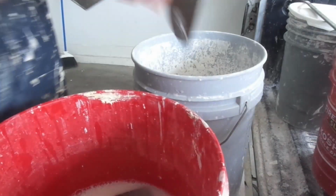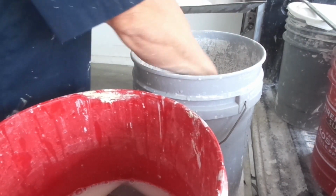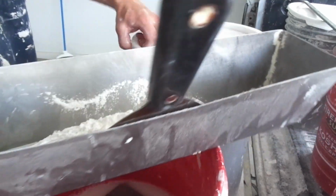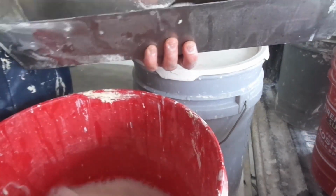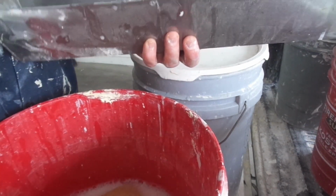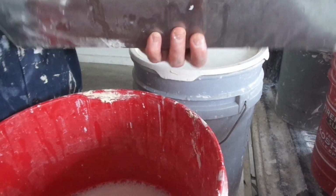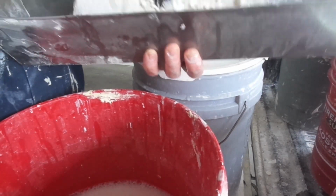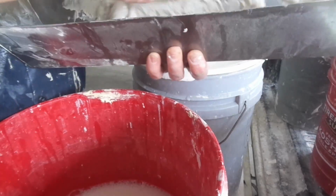Do a second coat. I won't need as much because all the fill work is done. So a quarter of a pan, if that, of mud. Add our water, mix it in. It's not going to be as thick as the first coat, so you want to add a tad bit more water just to thin it down. We don't want soupy mud. We don't want mud dripping off the ceiling. But we're going to do a skim coat.